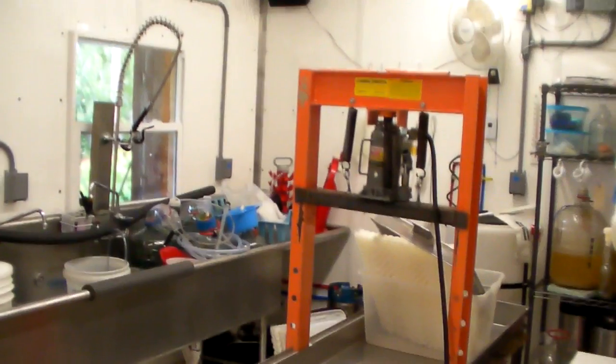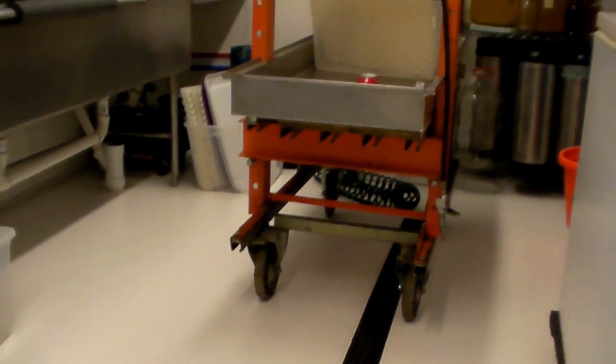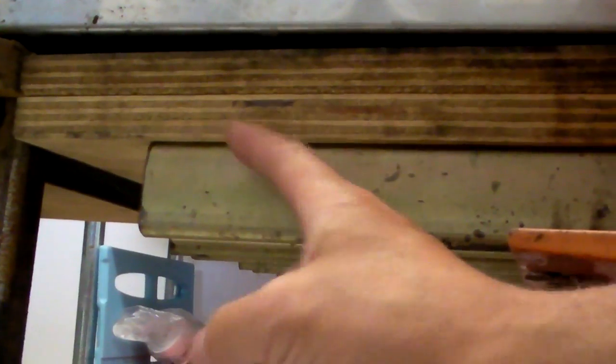There be the press. You'll notice the press is on a moveable set of wheels — it's on a moveable platform. The original press stopped here. You'll notice I have doubled up plywood and channel. People have asked me what do you support the press tray for underneath the pressure point — that's it, and that's all in the original video. There's a significant amount of steel underneath that plywood that is more than adequate for handling the pressure of the 20-ton jack.